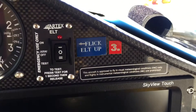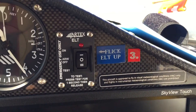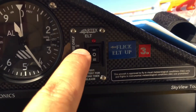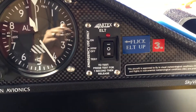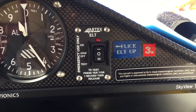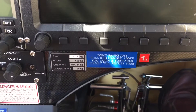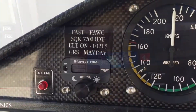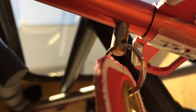Step 3: see number 3 in front of you. That refers to the ELT, or Emergency Locator Transmitter Beacon. Just flick that switch upwards to the single dash position, and help will come. But of all of these steps, step 1 is the most important in an emergency — just pull that red parachute handle downwards and forwards with a firm steady force until you hear the parachute rocket deploy.